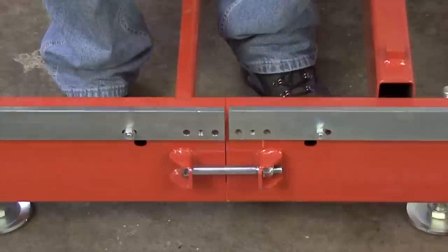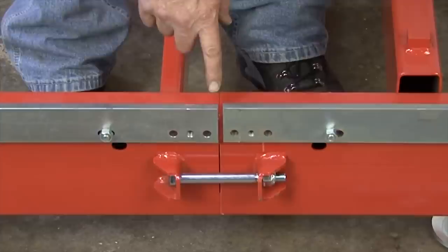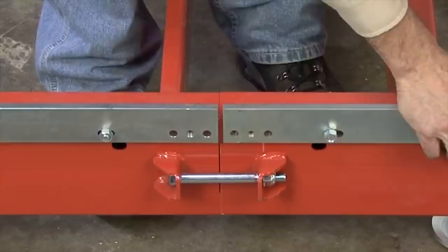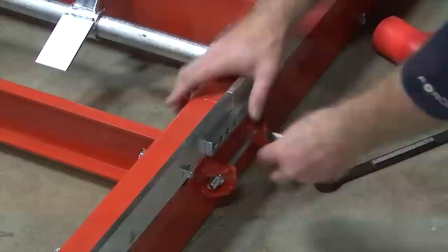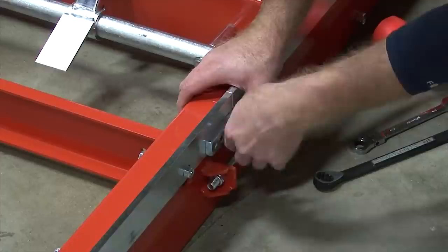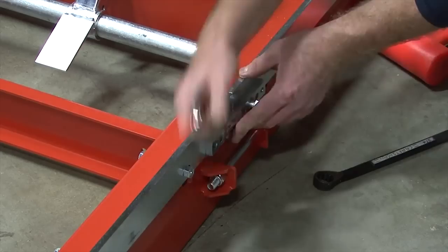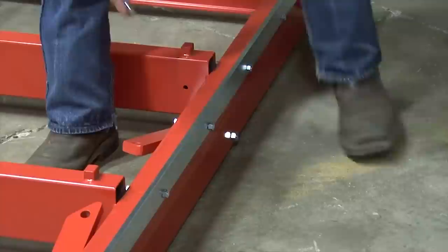Next, install the main rail coupler. First, make sure the rails are tight against each other. If not, loosen one of the rails so that it will slide — loosening the eight bolts that hold the rails onto the main tube will allow this adjustment. Then install the connecting coupler using two hex head bolts. Gently tap the coupler using a rubber mallet to start it into the holes provided, then tighten the hex head bolts evenly until snug. If the rail was loosened, retighten those eight bolts at this time. Repeat this whole process to connect the last remaining bed section.